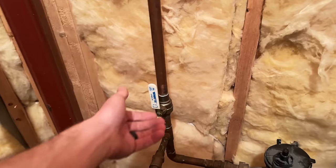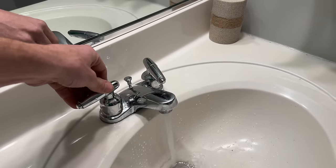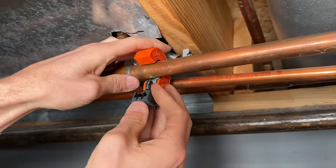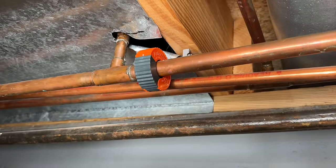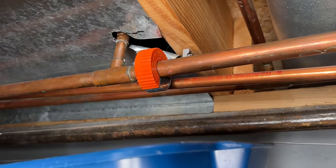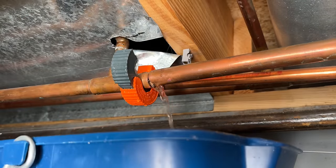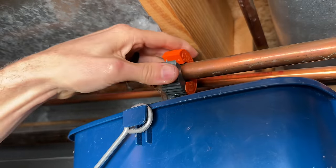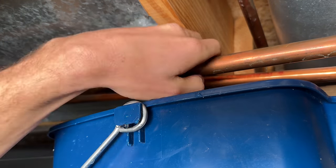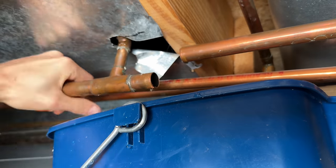To start the repair, turn off your main water shutoff valve, then go to the lowest point in your home and open a faucet or shower to drain down the water as much as possible to reduce the mess. This is my go-to for cutting open copper pipes — the auto-cut tool. It's great in tight spaces where a normal pipe cutter can't get rotation because it starts hitting the other half-inch copper line right behind it. Don't forget your bucket when you open it up.